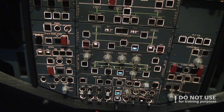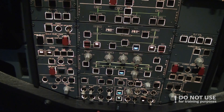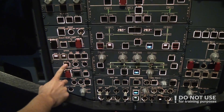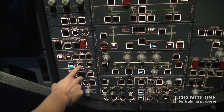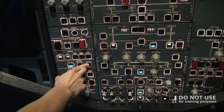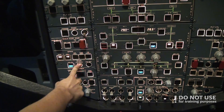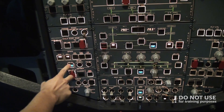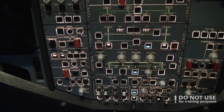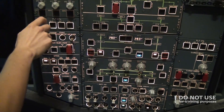After that we check the cockpit voice recorder. We put it on the ground and push the test button — there should be a sound every four seconds. We erase what was done before, the test is completed, and then we turn on the EDRS system.